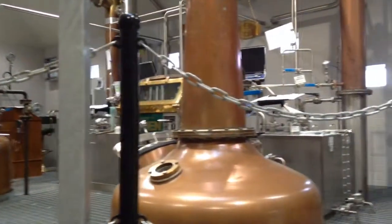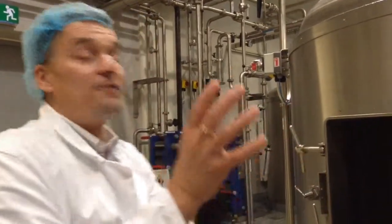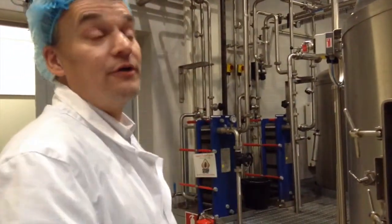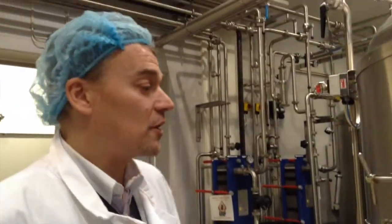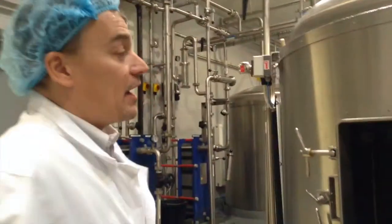The important thing for me when I designed this distillery was that I wanted traceability from A to Z. So it's actually balanced that one mashing is one fermenter, is one wash distillation, one spirit distillation, put to one cask. So we always have traceability from field with the barley to mashing to distillation to the actual cask. And we'll go through the cask when I come over there.